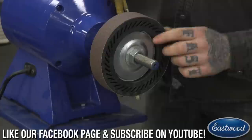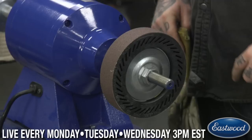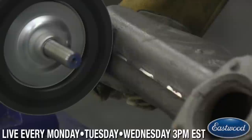One key tip — actually two — for using the expander wheel. One: the expander wheel is directional, so on the side of the expander wheel there are little arrows. Make sure you look at those arrows — our buff motors have a rotational arrow as well. Two: when you push in on the wheel, it actually deforms a little bit and it won't take away too much material, which can happen if you're using a grinder.